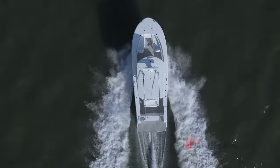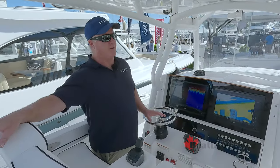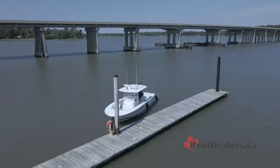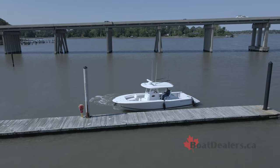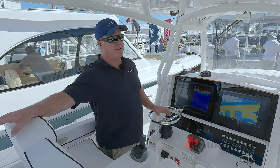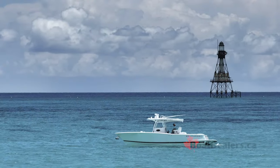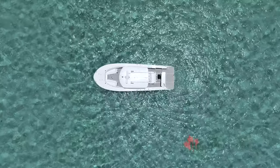Because of our new drive, we also have what we call low speed — what other people call a trolling valve. We can creep this boat forward while the engine's engaged, which is really nice around the dock and in tight areas for slow forward or reverse speed. For fishermen, it lets you troll this boat. Up in the northeast you can feather in front of a rip and stay in gear the whole time. Offshore and slow trolling goggle eyes, you'll be able to creep forward and live line your bait right off your riggers. It's a fantastic feature and we've brought it down to a smaller fishing boat.